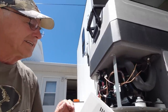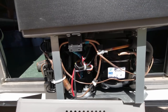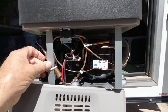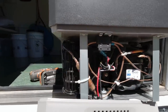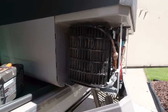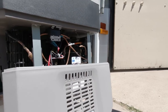This is the compressor inside — I thought you might like to see it. You can see it's just like the compressor in the refrigerator of your home. People mention a Danfoss compressor — I don't know if that's a brand or a type, but this is what's inside this one. It looks pretty neat. These cooling fins are going to have to be cleaned periodically. If they get covered in a layer of dust, it'll really decrease the efficiency, but it's just a matter of removing five screws and dropping this panel down, and you can get in there easily and clean it. You can see this runs on 12-volt and 24-volt.